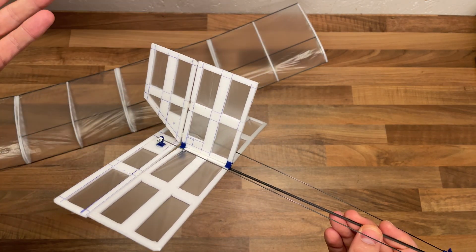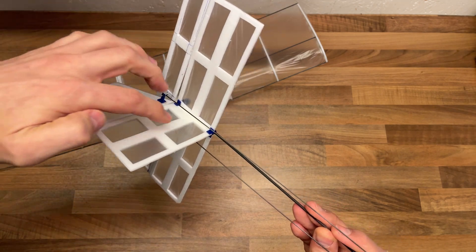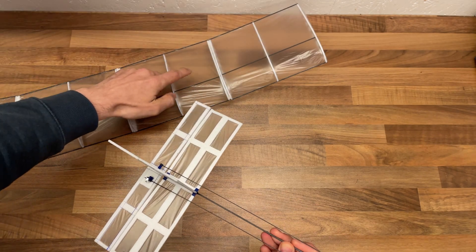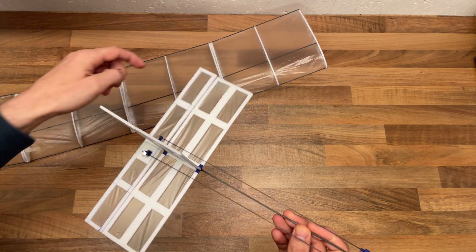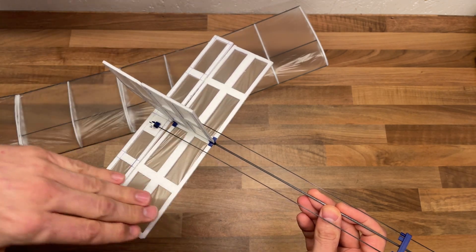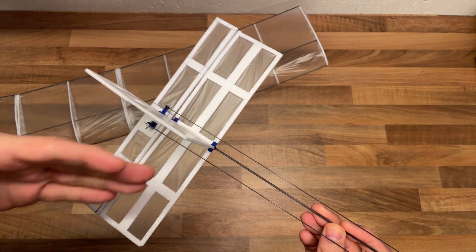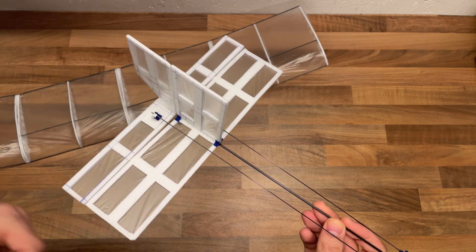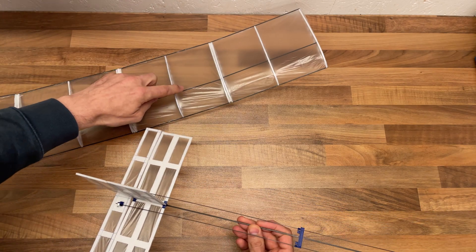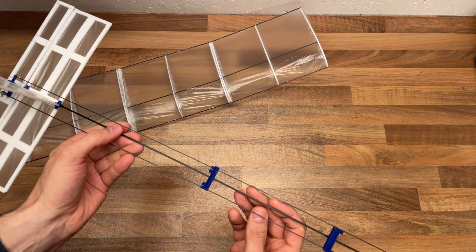It's again still D-Pron, just cut out pieces of it to reduce weight, then glued on the same plastic I'm using on the wing. So it's not the exact same shape as the original model, but it does the job. It weighs 1.5 grams less than the original, and that has meant I'm hitting the CG just right. So that's very fortunate.